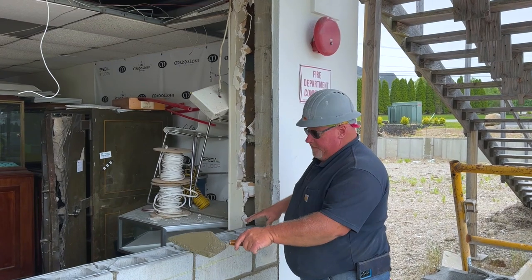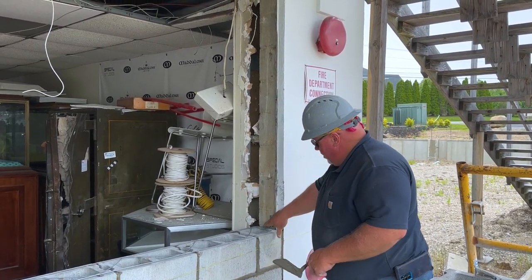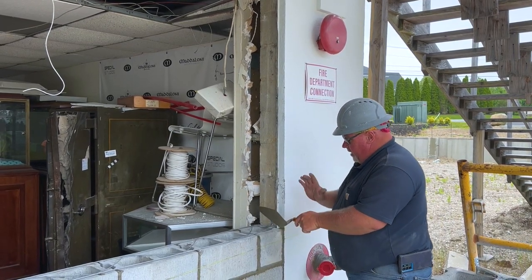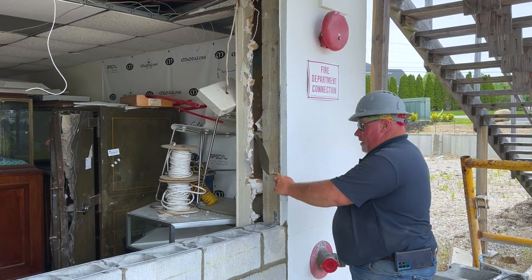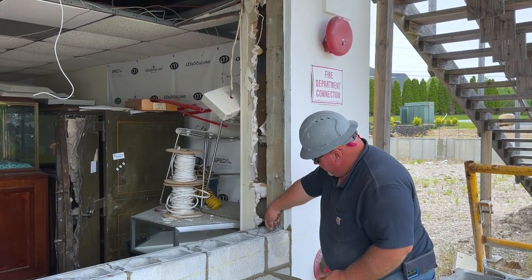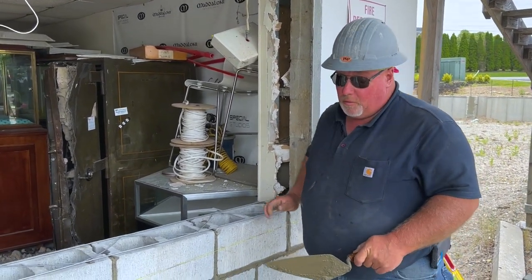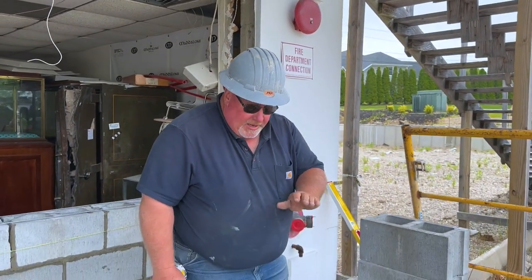You must tie when you're doing an infill. You have to tie your infill into the existing masonry, otherwise you could have a problem where it won't bond and it'll start shifting and moving — maybe this comes this way, that goes that way. When you do it like we're doing it, double wall tie, double hip pins, now let's get into some basic techniques.